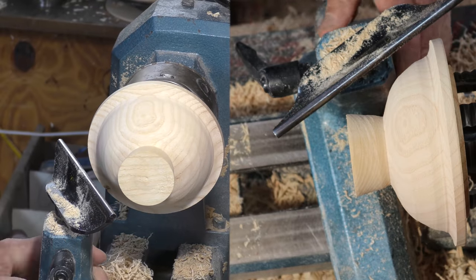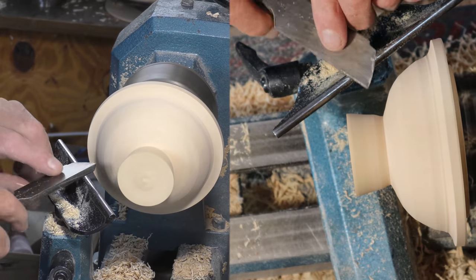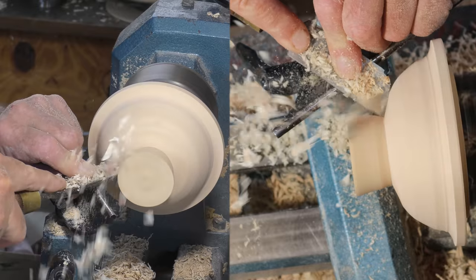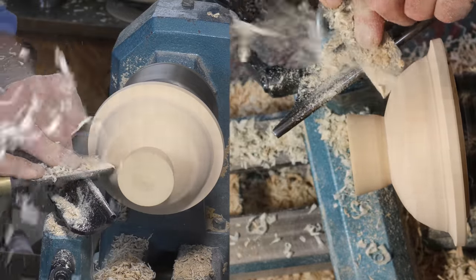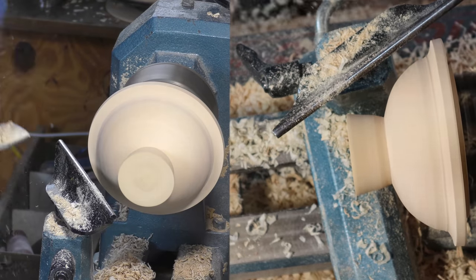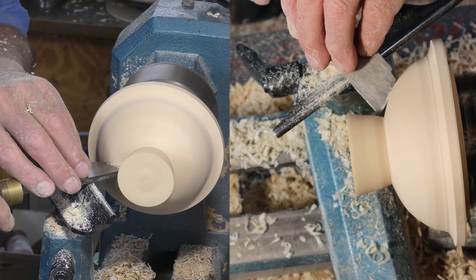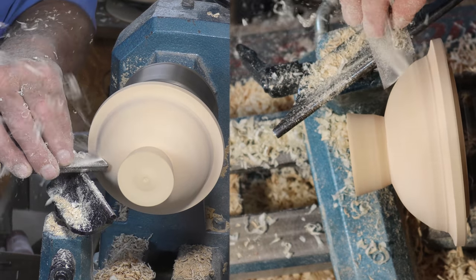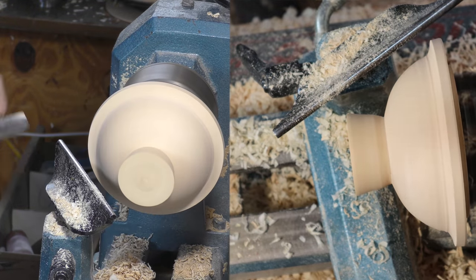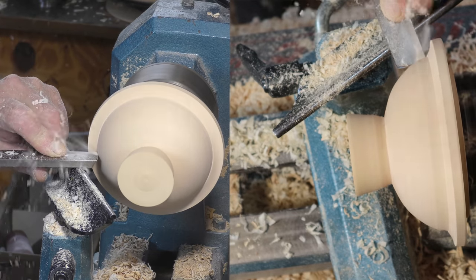So this will now come around. Ash, much better really to scrape it. Getting in there with a gouge isn't that easy. Because this is facework, you'd be wanting to take the cuts from the smaller to the larger diameter. Now coming around the corner here, I'm going to use the little square end. This is the 3/4 inch square end into the corner.